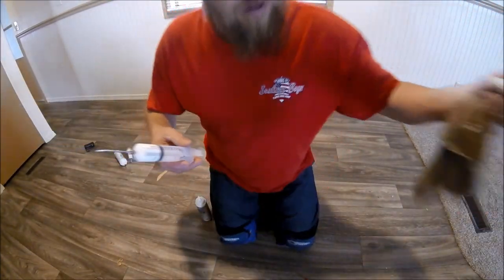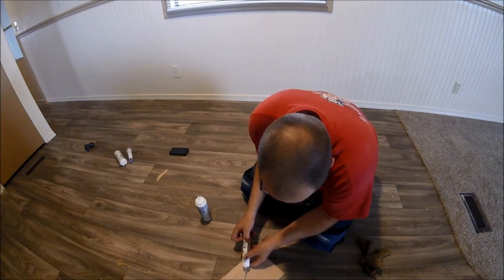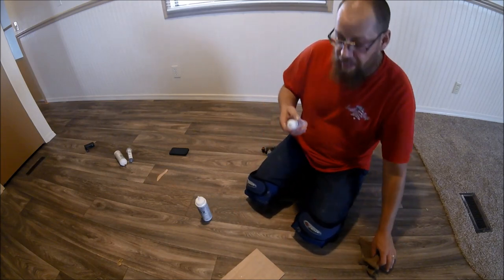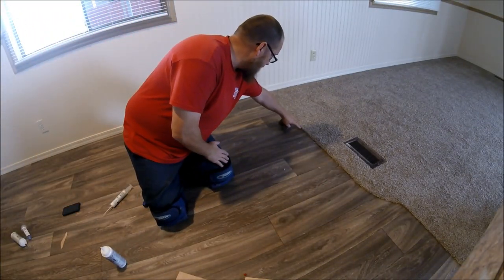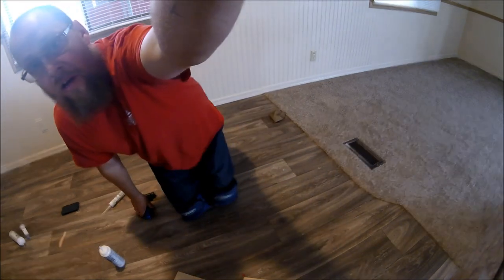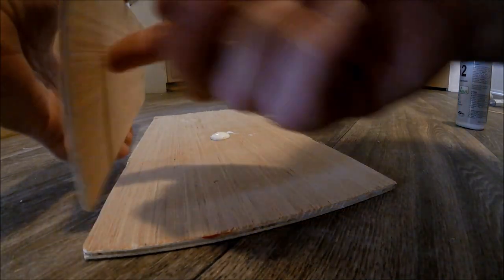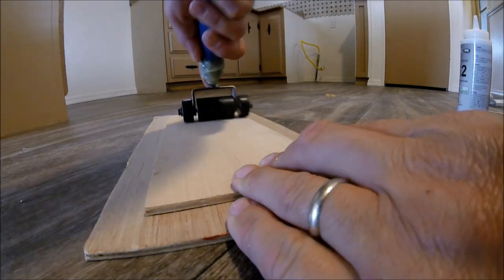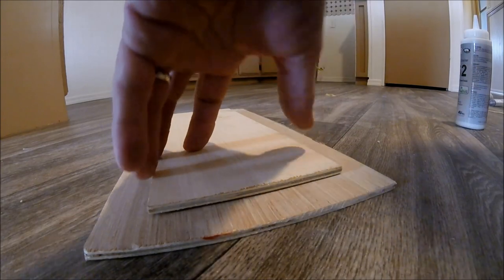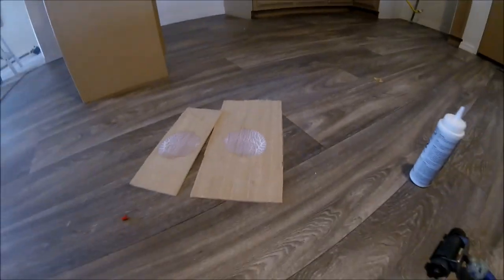Now I want to do a little demonstration here. I'm going to represent what it's like under the vinyl — I'll put just a little bit of sealer down there to show how much you need and how much you don't need. If you do too much it's just going to squeeze out. If I put a whole bunch down there it's going to squeeze out right here at the edge of the carpet and make a mess. That little bitty dab — watch this — I'm going to act like this is the vinyl and I squeezed it underneath, then roll it with the roller. Watch how much coverage we got out of that little bit. See how big an area that little dab covered? We don't need a whole lot of glue under here.